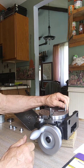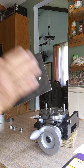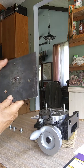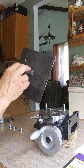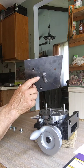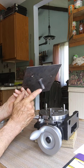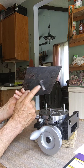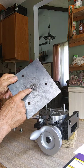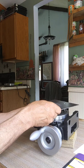I also made a flange — it's just a piece of steel. I haven't cut the reference circle yet, but I'm going to put it on the milling machine to do that. Don't cut your reference circle until you've welded everything together. I made a Morse Taper 2 shaft on my lathe, because the hole in the middle of the table is Morse Taper 2. The shaft goes through a hole in the plate and I welded it there. You put that on, the shaft goes into the hole, and then you position your T-bolts.